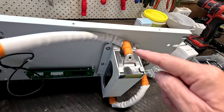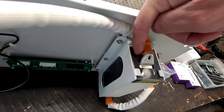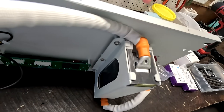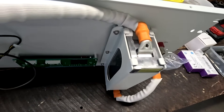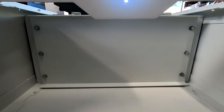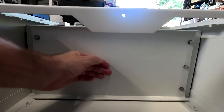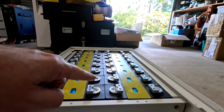So we go with that and see if we can finish the battery box today. You really have to mount these two cables top and bottom first, because you have to tighten this allen key screw underneath — and this is only possible from the front. This is the correct order; otherwise you can't reach it anymore. We have mounted our compression plate here with 0.5 newton meters each on the screws, which makes in sum 3 newton meters, which gives us apparently the 300 kilogram force recommended by the manufacturer of these batteries.